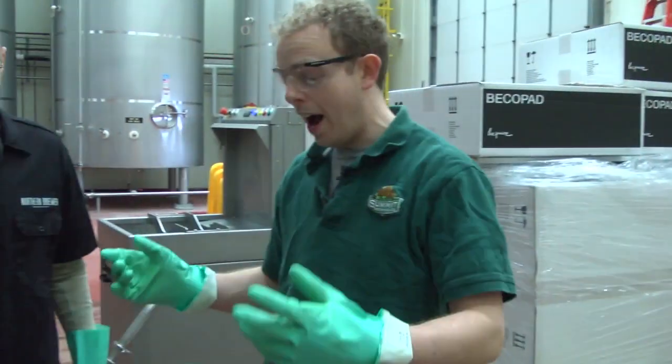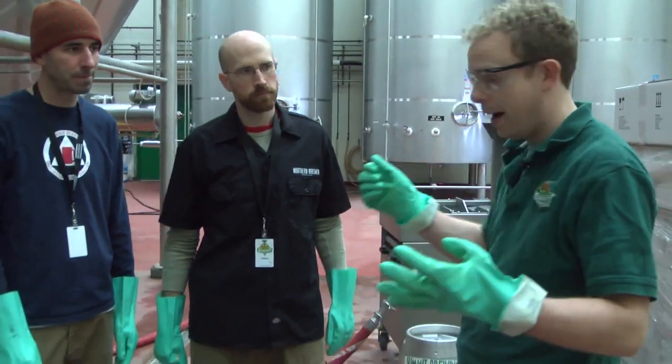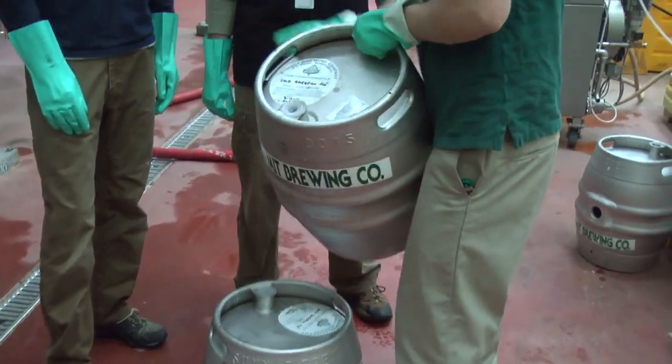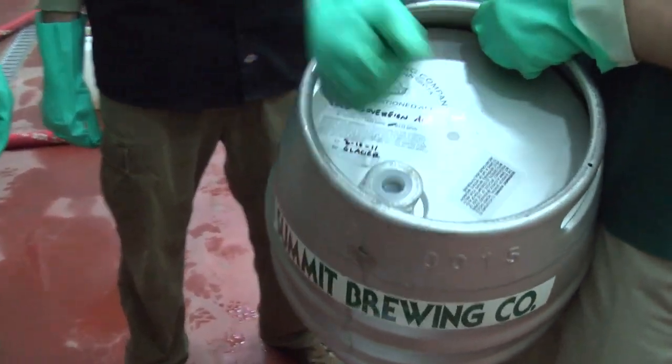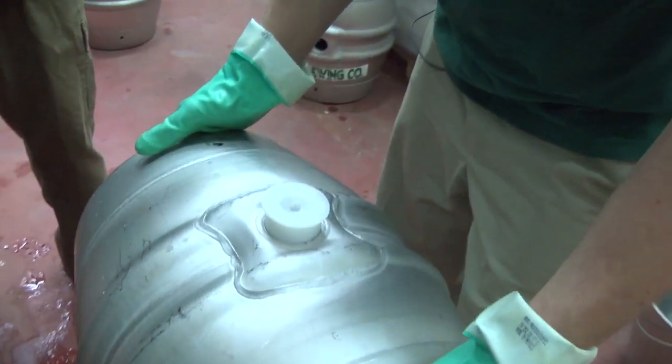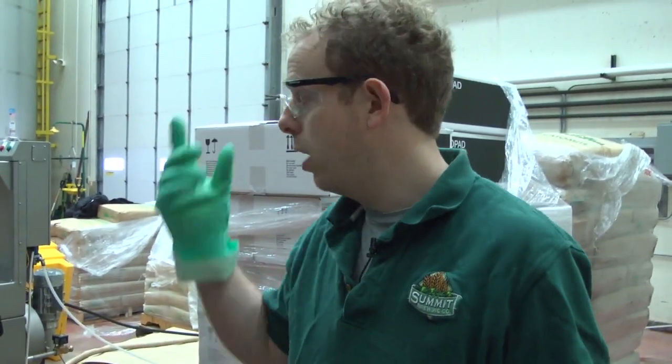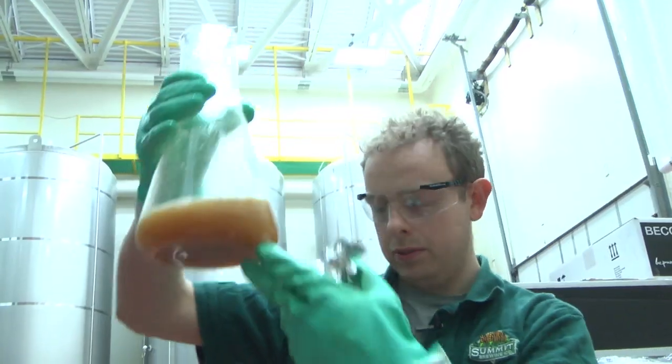So after we've finished washing the cask, we'll sanitize the cask. What we'll first do is add our Keystone bung. Literally, we would just drive the bung into the Keystone bushing. Fill the cask through the shive opening. We use a peracetic acid sanitizer for all of our casks. We also use it on bright beer tanks. We're going to make our additions.